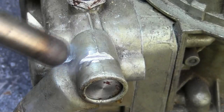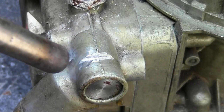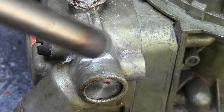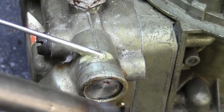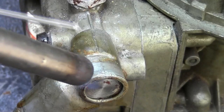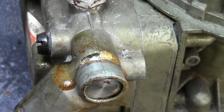In this demonstration I'm working with a pot metal or zinc die cast carburetor. Because this piece is heavy, I'm going to do more preheating than usual, so I'm doing a broad heating here. Then I'm adding my flux — that flux starts to bubble and starting to turn color, that's when I'm adding my rod.